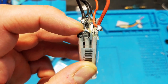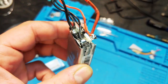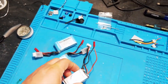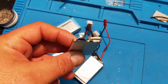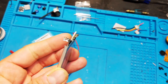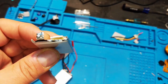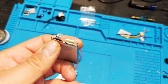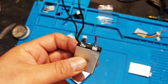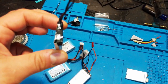Once you peel it all back it comes apart except at the tabs. You have to heat these tabs up and be really careful not to overheat the pack. I found you need a really good quality, high-heat soldering iron. I put it at 800 degrees Fahrenheit for about three to four seconds and pull them apart quickly. When you do, you'll get something like this — a single cell with a balance lead on it. We're going to remove those old balance leads because we'll put new balance leads on the 4S pack. One side is negative, one side is positive.